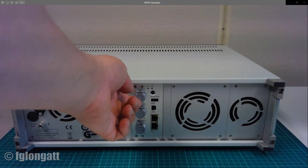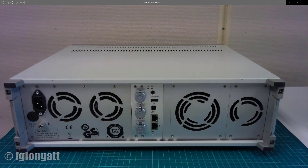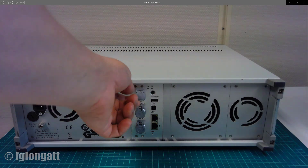Finally, there are connectors with very good weather protection — these are auxiliary and external connections. The idea of those auxiliary and external interfaces is that some protection tests require external data. For instance, if you are performing any tests and you require synchronization, the CMC256 Plus can take a signal from a satellite system to synchronize the measurements using the protocol IRIG-B. The timestamps can be synchronized using the GPS system. We will discuss more about that later, but you need to be aware of those connectors and their potential use.